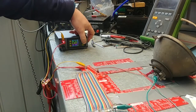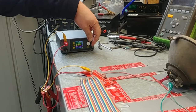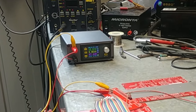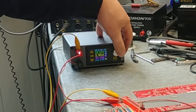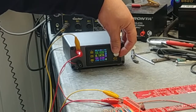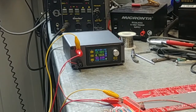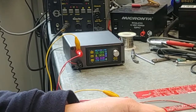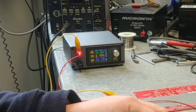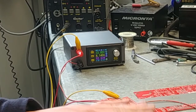I'll slowly but surely increase the current and voltage running through this one. I'll start by increasing that current limit, running it up to a 4.1 amp limit. At that point we're capping out at about 3.9 amps and at 12 volts. I'll go ahead and increase the voltage a little bit — okay, so that's at 13 volts pulling 4.1 amps. Again at 4.1 amps through a single strand on the DuPont cable there is still no noticeable temperature increase, so I would be relatively confident running 4 amps across that one.